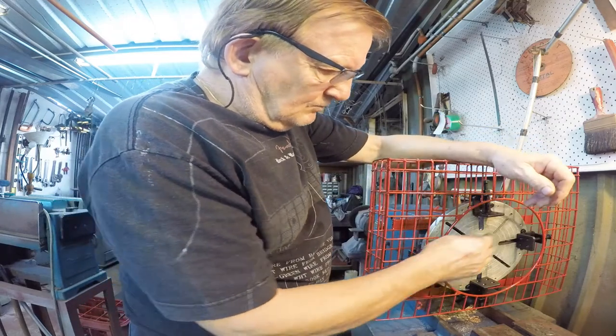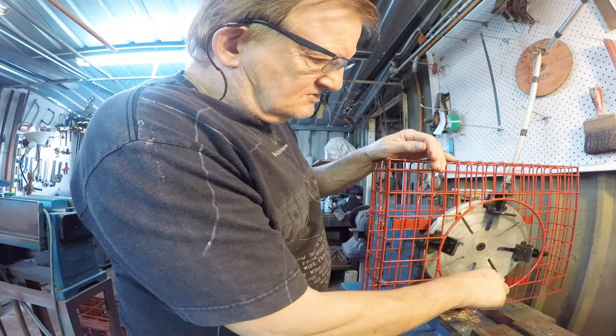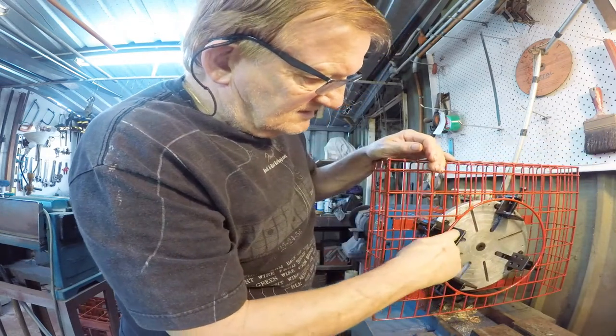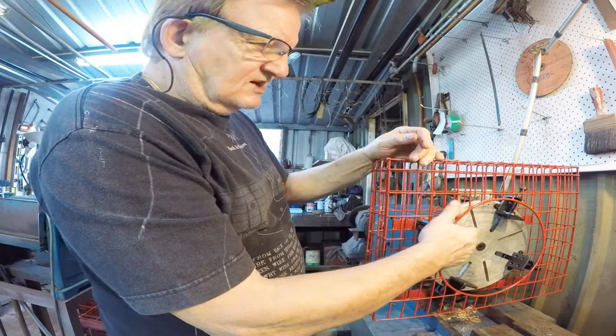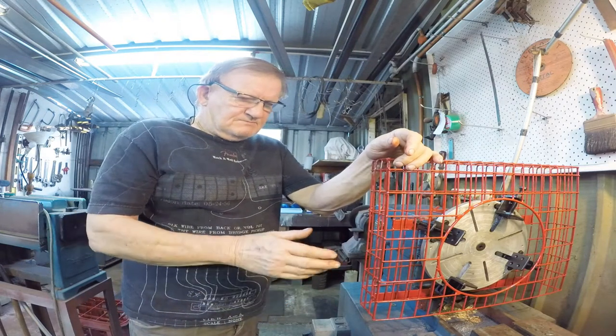I usually set up with the wood first and just operate by hand — move the chuck around so I can get the drill behind and drill holes for screws to go into bits of wood. You have to fasten the wood in these chucks; it's a bit too dangerous whirling around by itself, and at least you protect it.